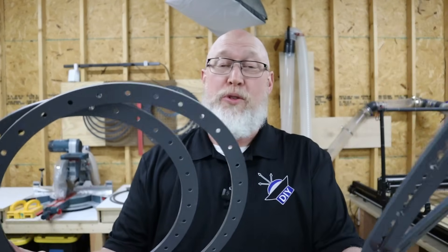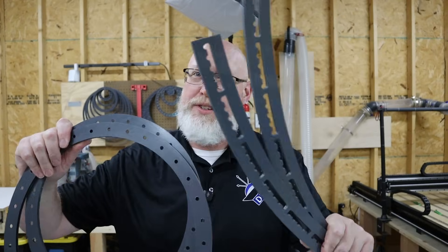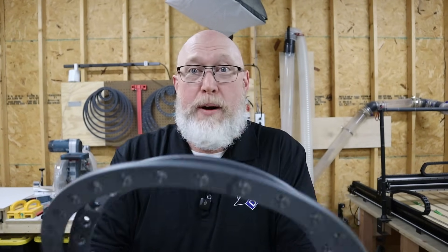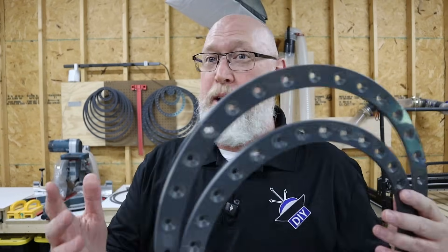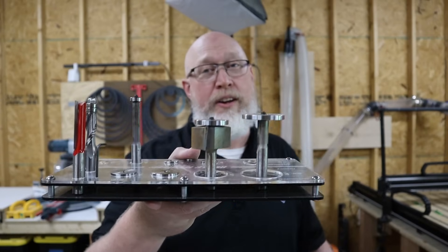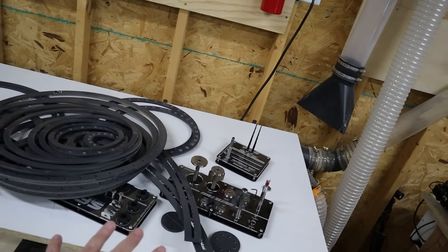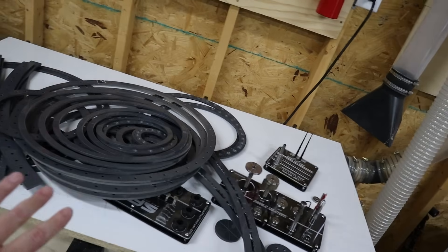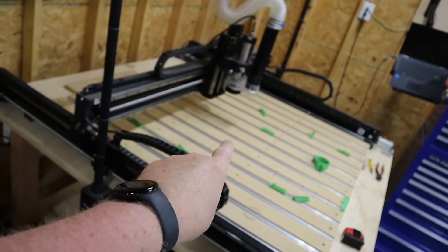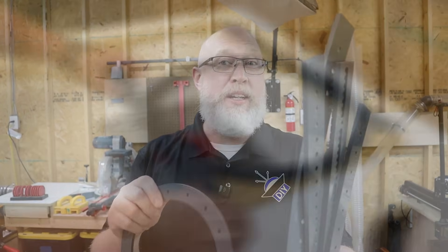And then there are these things — templates to use with your router. Templates like this are the gold standard for car audio fabrication, and at first glance they're not very expensive. They come in sets, most priced around $100. But they get expensive real quick because these templates are all part of a larger system. These rings are primarily used for speaker holes, but they can't make an infinite number of rings for every possible speaker. So you've got to combine them with flush trim bits and rabbiting bits with different size bearings to oversize or undersize your speaker cutouts. This setup — three different kits, one tray full of bearings, plus router bits — if you go buy all this today, you're going to be out $900. That's one fifth of what I paid for the fully decked-out CNC machine.